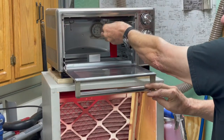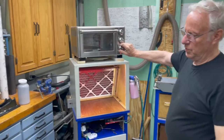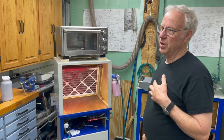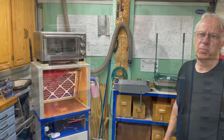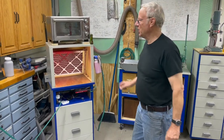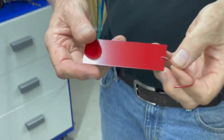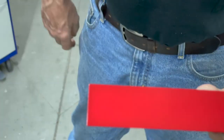I take it and hang it in the oven very carefully without getting burned. That's going to bake. After it flows out, it has to bake for 20 minutes. It's set at 400 degrees right now, and I can turn it down to 350 and bake it for 20 minutes afterwards. Due to the magic of cinematography, the 20 minutes has gone by and I can now take this out of the oven — it's fully baked. As you can see, that's a very, very nice finish and it won't scratch off. It's cured completely.